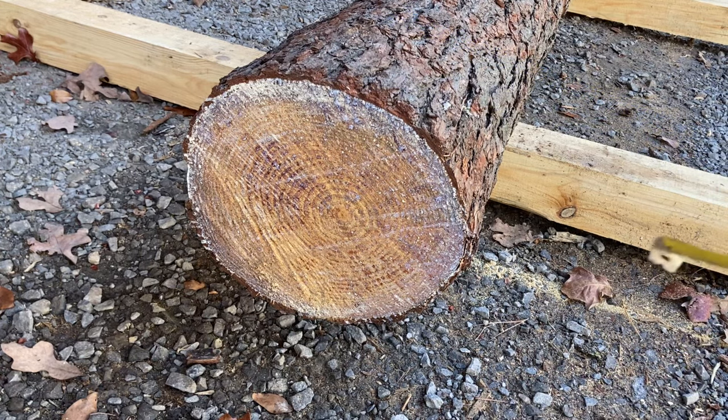As we saw that log, we need to be aware of this because it will cause the boards, as we cut them, to bow. Most people call a board crooked if it's bent on its wide axis, and bowed if it's bent on its narrow axis. So a flat board laying like a diving board that tips up at the front would be bowed, and a diving board that turns to the left or right would be crooked.